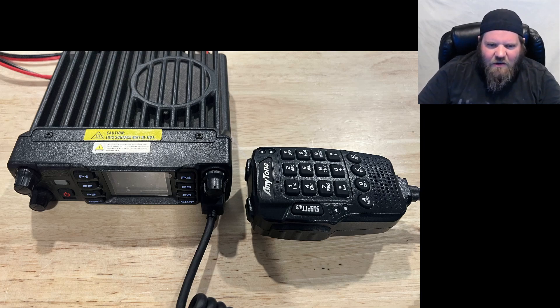I also have an Anytone VHF/UHF radio. It's an extra radio I had lying around, and I chose it because it has APRS. It gave me some fits in the past specifically with audio on the mic, but after research I found it was a firmware-level problem, which I resolved by going to an older firmware. I decided to keep it in my go box — it's great for APRS during outside events or on the road with my fifth wheel.